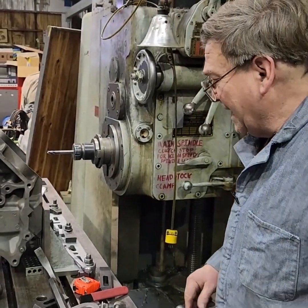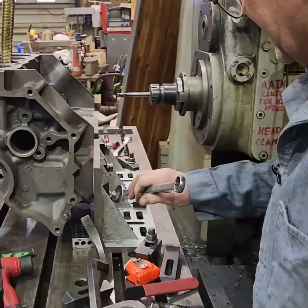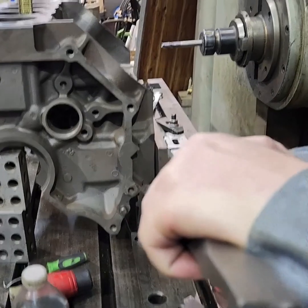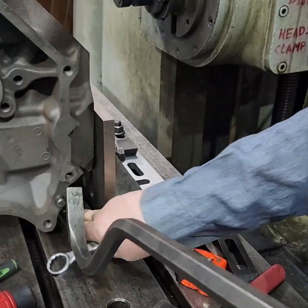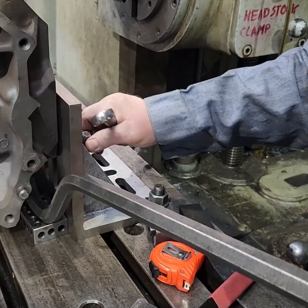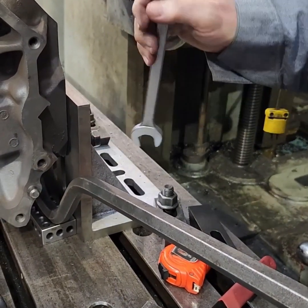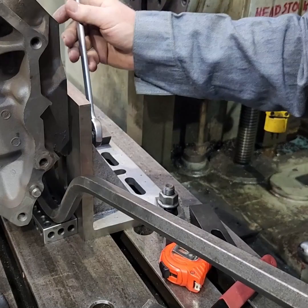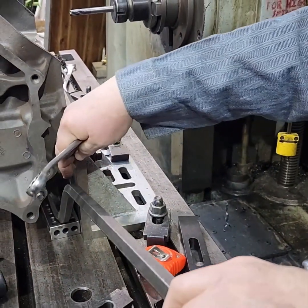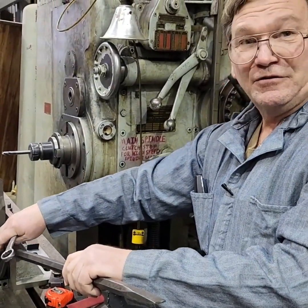I did the one side already. One of the big things I want to mention here is, as you're doing this — it will basically suck up to this plate — but it's better to not be fighting gravity. Come in here and lift the block up, then when I tighten it, instead of it having to lift, it can settle down. That makes it a little nicer as far as knowing that it's going to match with the angle plate instead of catching a little below and wedging.